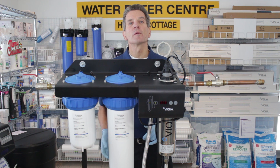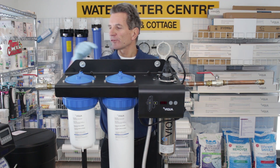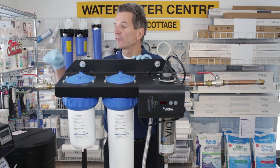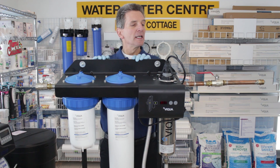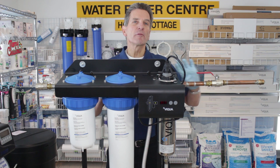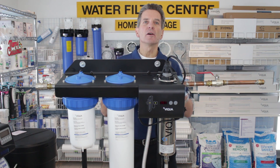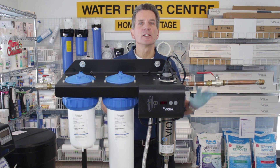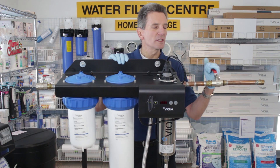You're also going to need a screwdriver to remove the plug from the bottom of the filter housings. We're going to start by shutting off the flow of water — there should be a ball valve or some kind of shutoff valve on the inlet side. Before you shut off the outlet side, go around the house and open up a faucet or laundry sink. Let the water run until it slows to a trickle, then close the outlet valve.